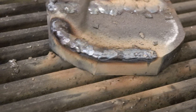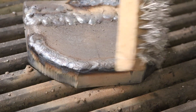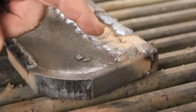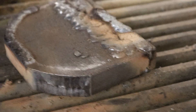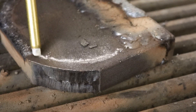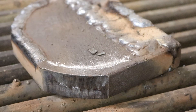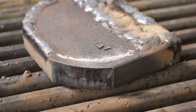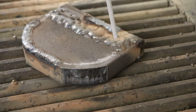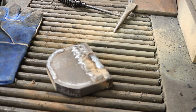It freezes really fast. You can see how it holds a very nice edge, which a lot of people like in hard facing. If you look back here, I put a soapstone line on here, and a lot of inexperienced welders will put a soapstone line just so they can see where to start and you can weld it towards the edge. Common hard facing width — pinky fingernail wide is plenty. About 10 degrees. 635 is like that too; it won't burn the edges away.